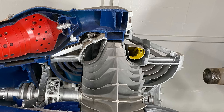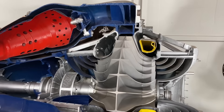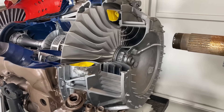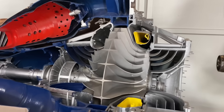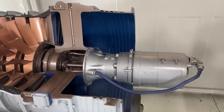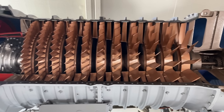This is the compressor section. The compressor on the Derwent is not an axial flow compressor with fan blades like we see on modern jet engines — it is a centrifugal flow compressor. The air flows in through the side of the engine, then gets turned 90 degrees in towards a big impeller disk. At the time, this was felt to be the easier solution. This disk spins very fast, and as air flows in through the hub it's flung out towards the outside, increasing both pressure and velocity. These centrifugal compressors give compression ratios of about three to four to one, whereas the more common axial flow design gives only about 20% compression per stage — so you need many stages in sequence to achieve the compression required for the combustion section.